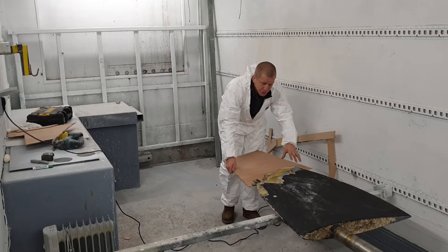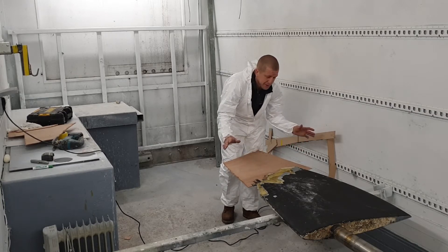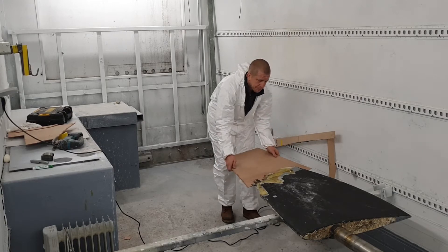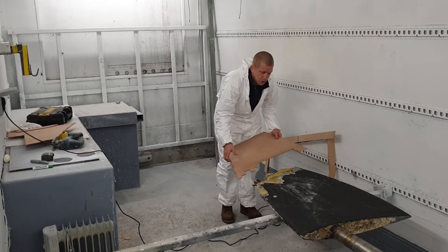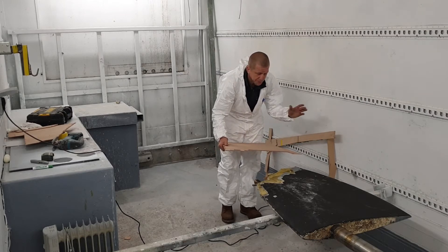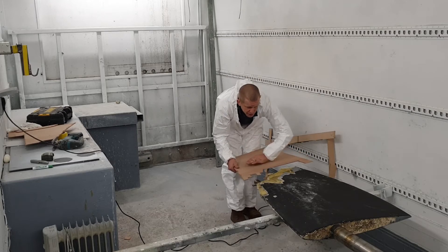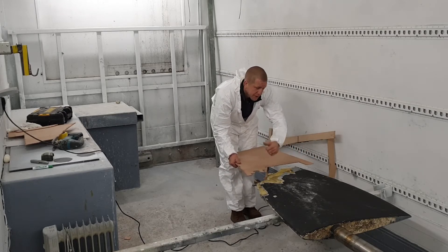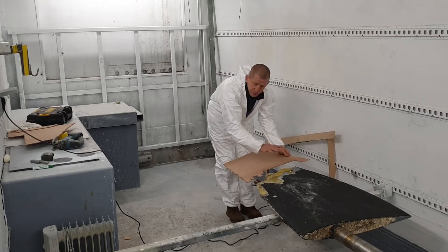Remember, this is a plug - it's going to be thrown away. It's not structural; it's going to be thrown away in a couple of days anyway. All it's got to last is long enough to make a moulding. We're not going to be transporting this anywhere - I'm just going to make it here and mould right here. So it's not like it needs to be strong enough to move around or anything. It's all going to use is just polyester, cheap filler, cheap as we can. All we've got to do is get its correct shape. Once you've got the shape in it, we'll mould off the top of it and scrap it anyway. So I'll get this glued in and then we'll start with some filler work.